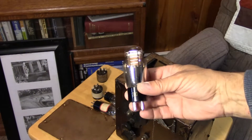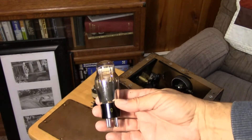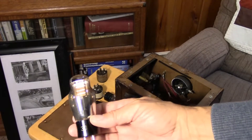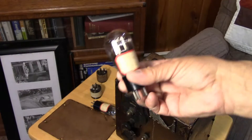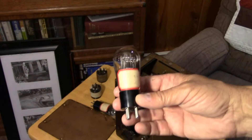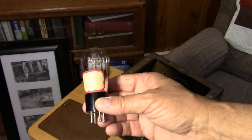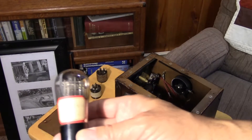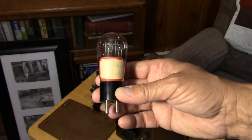Some of you might be familiar with the Type 30 triode. Here is the common ST base style of construction on the Type 30 battery triode, which is late 30s vintage. However, the tubes that came out of this radio are the older globe style, closer to 1930. The tube was developed in the late 20s but first in production in 1930. That again places this radio in the early to mid 30s — it can't have been built in the 20s with these tubes.